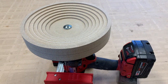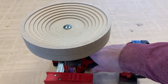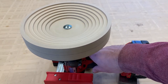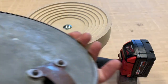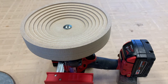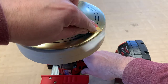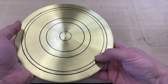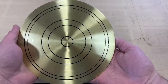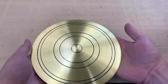Here's our setup. I've got a drill mounted in a clamp, and I've got my shop-made chuck here mounted just with a carriage bolt and a nut on the backside, attached to my drill on low speed. This will be manual control and I think we're going to get pretty close to what we need. The back of our pendulum bob has some things on it that are not flat, so I'm going to use some pieces of paper towel to prop up the low spots. Here's the finished bob — came out pretty well. There's a little bit of irregularity in the wax, but I think it looks a heck of a lot better than it did. And this is an old clock, so a little patina is okay. I'm pretty happy with how this came out. I've got a little bit more polishing to do, then we'll get the bell mechanism back together.